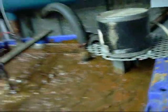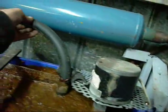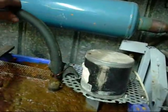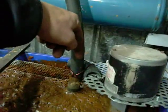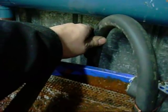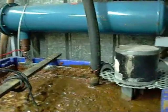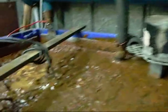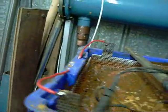So I've got the pump mounted in permanently - this is the same one I used for my early Morris 1100 test. I'm going to run this out. I don't know whether I'll have a copper right angle coming through here and straight in, or whether I'll just bend this pipe out and tap into it somewhere around there, just angle this rubber pipe. It'll be nice to have it all in copper, but underneath I need something that's a bit more corrosion resistant, and the rubber hose does that job.